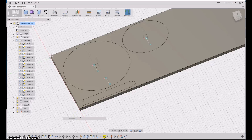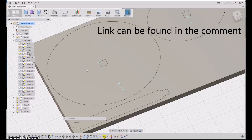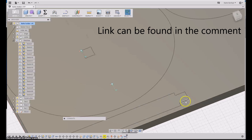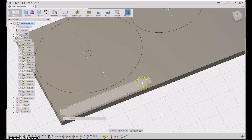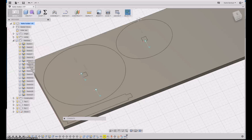I have used a plug-in that I found on the internet on GitHub that can be used for dog boning. If we zoom in a little here, you can actually see the dog bones here and there. Those are made in order to make the tenon go all the way down to meet this surface here. Next is to go to the CAM part of the program.